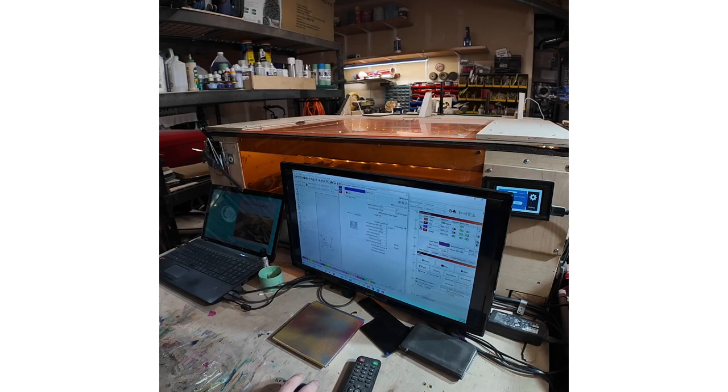I'm now going to, and I'm using fill also, do the same thing with the elk and the mountains, which is a vector drawing or SVG file, 300 dots per inch, leaving all the other things together. We're going to switch to individually. We're going to turn the output of both those layers on. Then we're going to go to our image setting. We're going to go 250 to, I think I'll go 7.5 because even in 35 watt mode, which is where we are now, it may burn things. I'm in grayscale mode. I'm just going to use 200 dpi as a starting point. We'll tinker with that a little bit when we get the chance. But that's what we're going to do our first run.